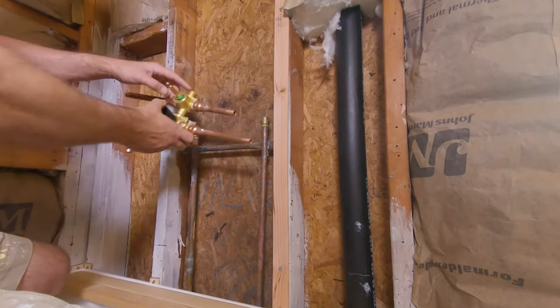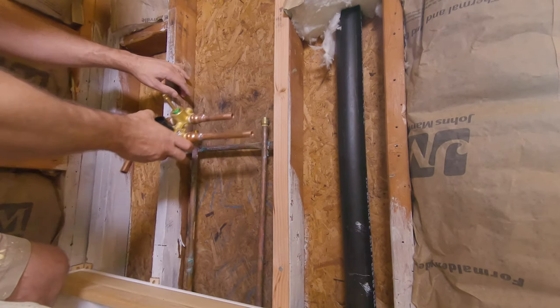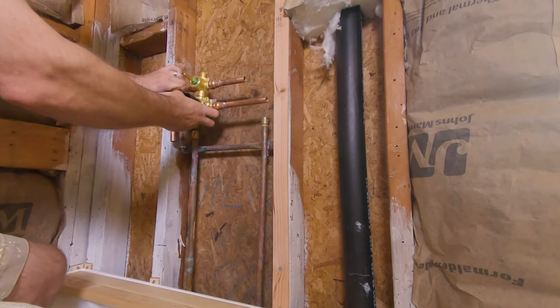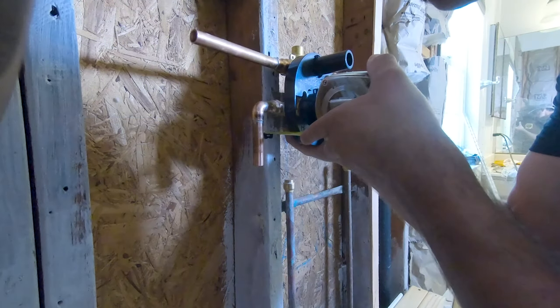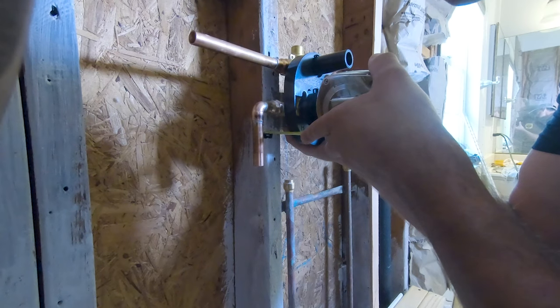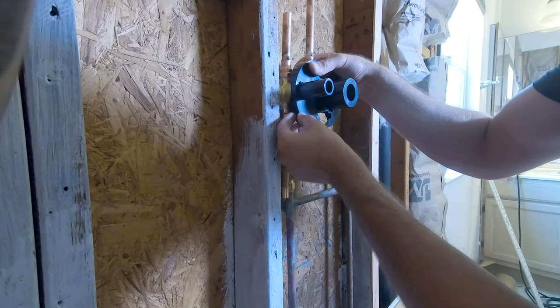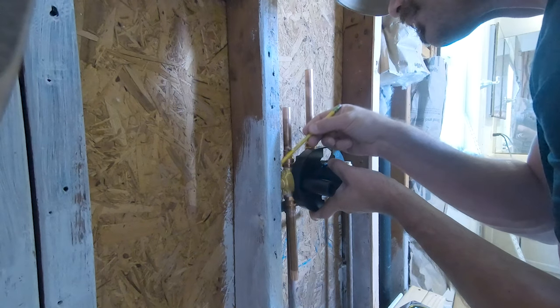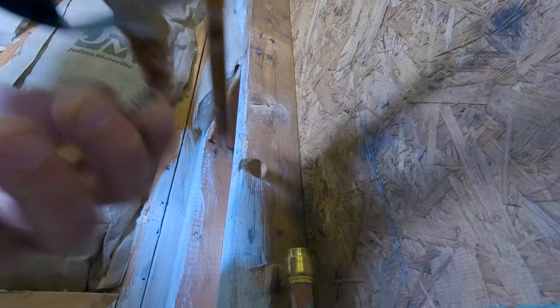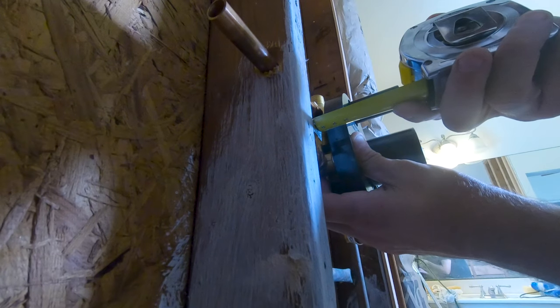That being the center of it, I know that this pipe is directly in the center. So I want it right on that center line right there. Boom. To the end of the mud guard is 2¼ inches. I'm gonna take this 2¼ inches and set this back 1¼ inches. That leaves this out about 1 inch from the wall, which is where we want it. That's how it'll sit. See, I'm right atop of my line right there. 1 inch off of the mud guard.